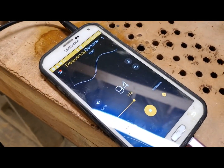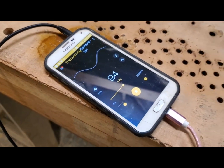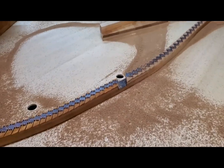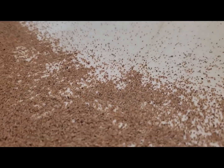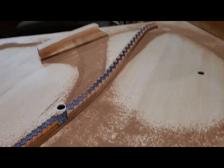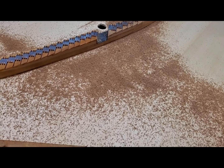So it looks like Mode 1 is about 47 Hz. I'm going to go back down and look for Mode 1, see if I can get in close where you can see the little sand moving. Yeah, there we go — the sand makes a pattern where it stops moving. Pretty interesting. There's the other side. Let's look for Mode 1, going down to 47 Hz.